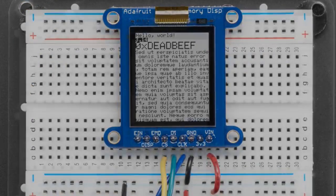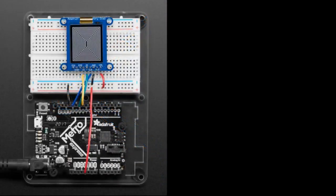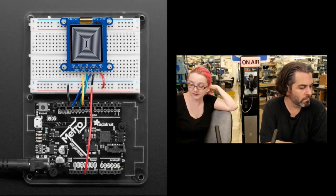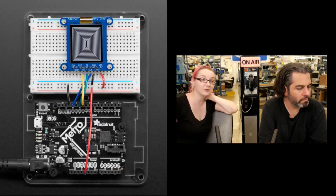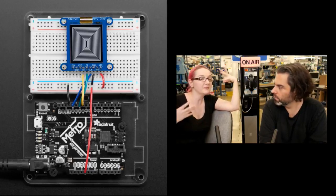This is a Sharp memory display. We actually stopped the 96 by 96 size display for quite a while — they got discontinued. Sharp doesn't make the 96 by 96 anymore. However, the good news is they make a 168 by 144, which is like four times the resolution, and it's even less expensive — which is really sweet. So this is even less expensive despite being higher resolution. There's a catch though: because this is a write-only display, you cannot use it with a device with low RAM. You need at least 3K of RAM to buffer. So this is a Metro Express — it's a SAM D21 with 32K of RAM. You can't use this display on an Uno, Leonardo, 32U4, or 328.